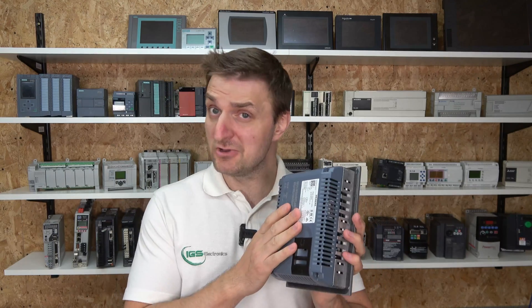Because Siemens has created the file as a restore file, you can load the program into the HMI using a Siemens SD memory card. But what we're going to be using today is a program called ProSave. ProSave is free software from Siemens — I will leave the link in the description below — which will allow you to load that file onto your HMI. That's the cheapest way to do it.